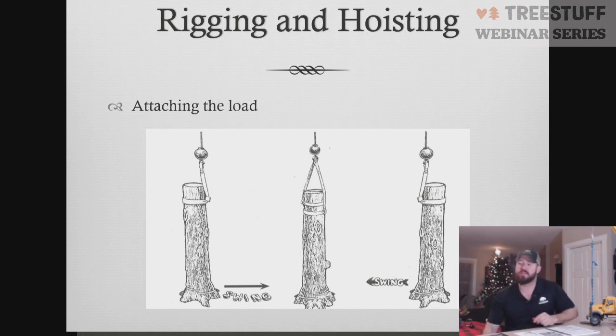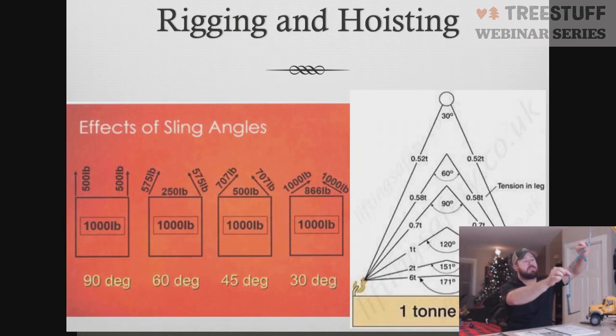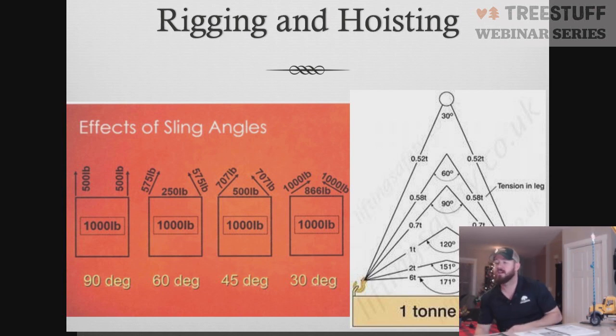When I look at sling angles, we have to remember the effects of sling angles. We talked about 90 degrees, 60 degrees, 45s, and 30s. When our slings start changing angles, the sling capacity changes. So in a vertical or straight 90-degree angle configuration, there's going to be a different capacity than if we had two slings operating at more of a 45-degree angle. Our capacities are different, so we have to make sure we understand that.